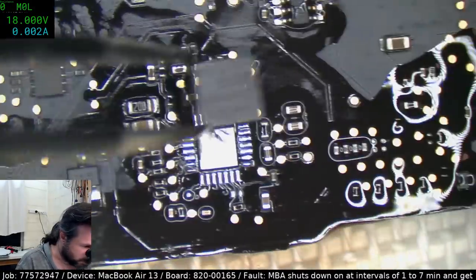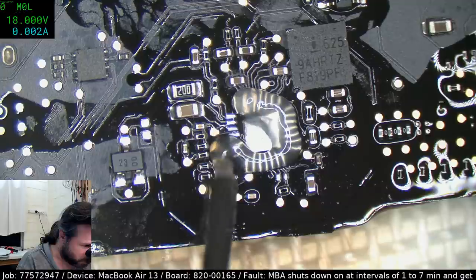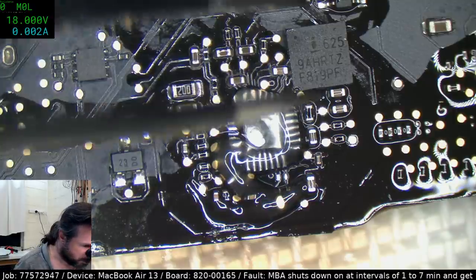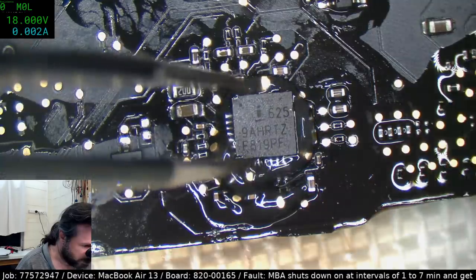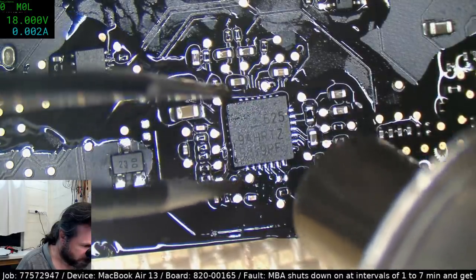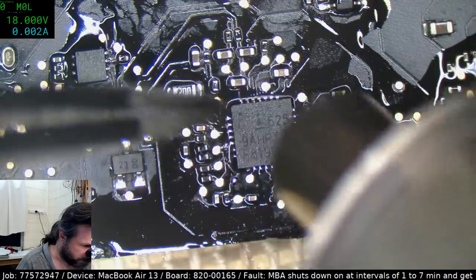I think you'd be fine with phones peeling off, especially things like that. I mean, okay, the new sort of faults that we're seeing, I find the iPhone 7 audio IC a little bit tricky, only because it does require a much tighter level of control to prevent you upsetting the baseband CPU beneath it. Oh, geez, I'm good. Yep. That was dreadfully put down. Well, I think you'd do fine on phones, pan off.